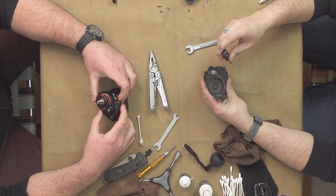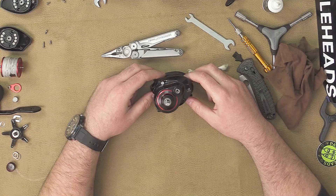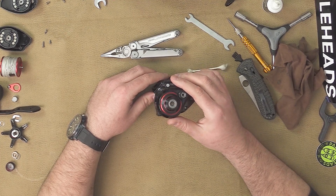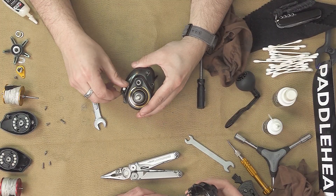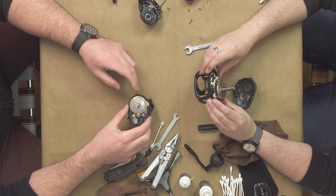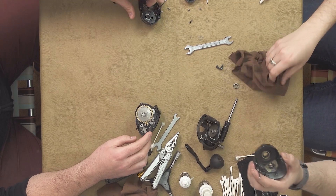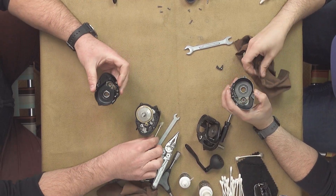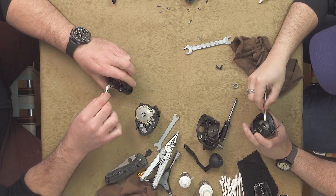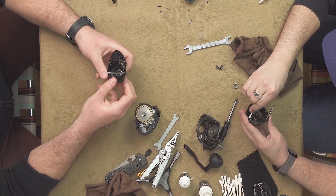Make sure you're supporting this plate as you're taking those screws out, and you're going to flip it back over. Flip it like that and gently pull this up. Give it a wiggle. Now do this carefully — just lift straight up. It might be a good idea to set this aside gently and carefully — there are little springs on that. Clean out the plate that we just removed; get all the nooks and crannies. The bearing stays right in there. That's all cleaned out.